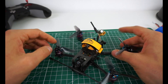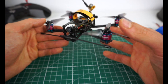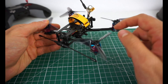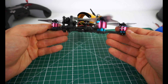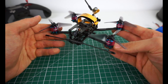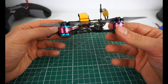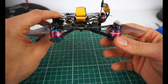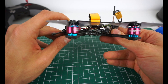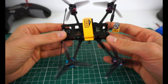On 2S I didn't have any problem with vibrations. Because if the frame is too soft and you have too aggressive motors and props on these micros, you tend to get fly-offs — the flight controller gets into a positive feedback loop and accelerates the motors in an uncontrolled way, so your quad tries to escape. That didn't happen. I could fly the Betaflight stock PIDs without any issues on 2S. I'll have to try 3S, because I simply forgot to pack some 3S batteries when I flew this yesterday, and we had rain all day today.